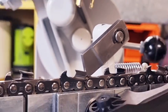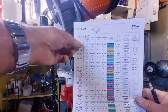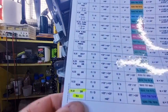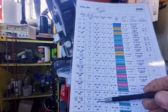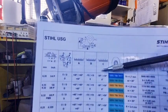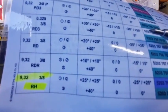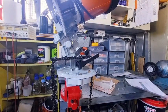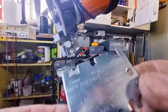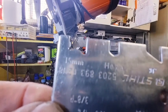Let's go back and review that once more. On the chart, look down the bottom for RH — rapid hexa — 25 degrees on the A column for the head, and 25 degrees on the C column for the top plate angle. So you've got your little hexa tool here — you can see 'hexa' written on there — and that's your 120 degrees. It's a matter of just dressing the wheel with a dressing block.